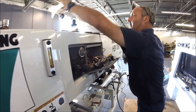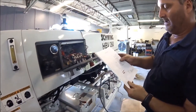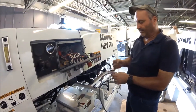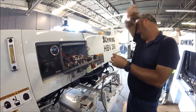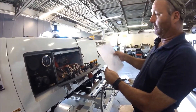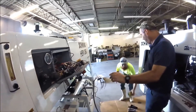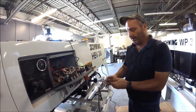Going on your schematic: you've got positive on white. So you're going to take your white wire and hook it to pump power — real simple, you can hook that to pump power. And then your next one, if you look at your diagram, green is for your forward. So when you press your button on your controller, you're going to get power on the green wire.